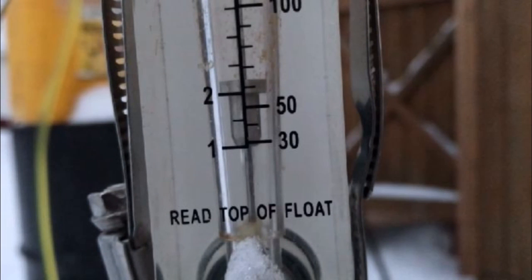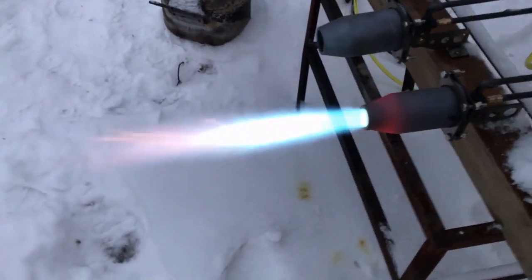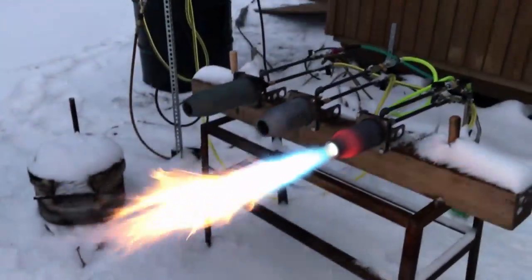You're looking at about 240 kilowatts of power right there. For the air consumption, we're at about 65 liters per minute. These high velocity burners heat up the area so much hotter than a regular flame can because the temperature is far higher. So you don't need that big blasting fireball that's going to burn up the bottom of the boiler. This just more evenly heats up the air, and because the flame has such a high velocity, the turbulence in the firebox is far higher, so you get a more even mixing.